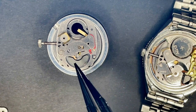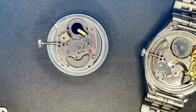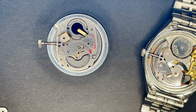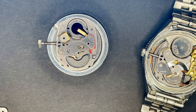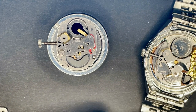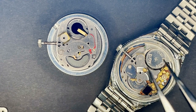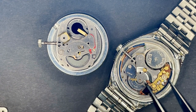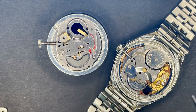Now this movement is actually a Timex DynaBeat. It's supposed to be their more high-end electrical movement — the high beat version. It beats eight times a second instead of six times a second like most of the electric Timex movements. This movement in the Q is six beats per second, but it's regulated by this circuit board. The DynaBeat does not have that circuit board.